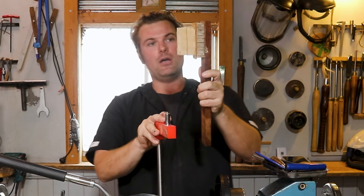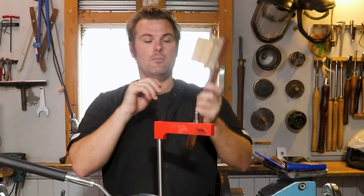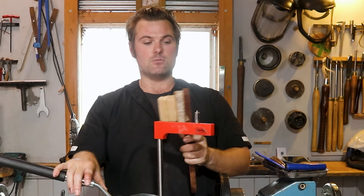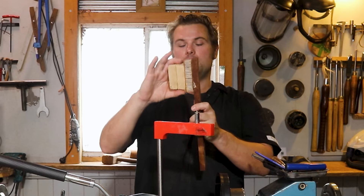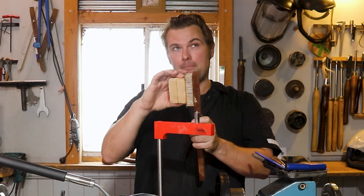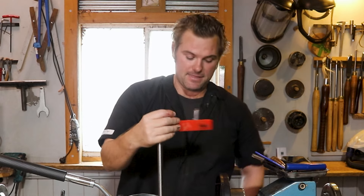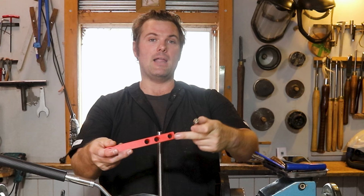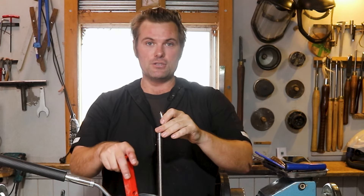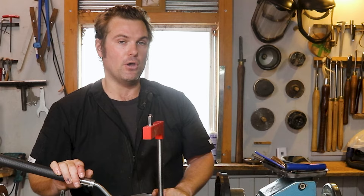The last jig is what I use with my laser guide. This jig is predominantly used when I'm using the Max 4, but I'll show how I use it with this unit as well. The block of wood represents the width of the dovetail jaws, another block is for the Max knife, and another is for the small knife. The laser guide has three holes which represent three different blades for the Max 4, but you can use it for this unit too — you just need to align the laser up with the blade and then run it around the back.